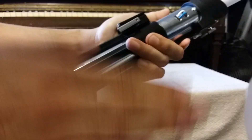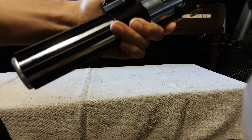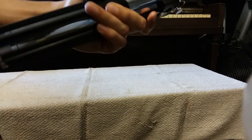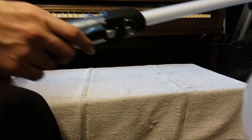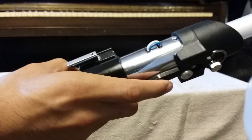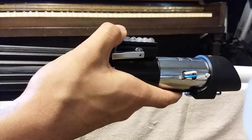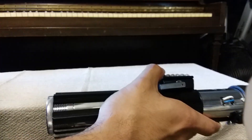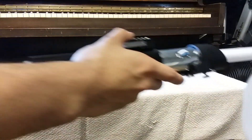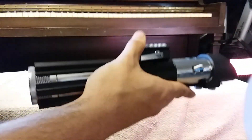You can also hold the auxiliary — if you hold the auxiliary for a second and let go and it makes that beep, it goes into the volume menu. The auxiliary button turns the volume down; press the power button to turn the volume up. When you hear the beep you know it's at the end and can't go any further. Then hold the auxiliary for a second and let go to exit the volume menu.